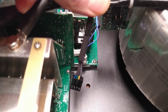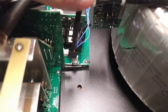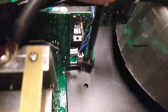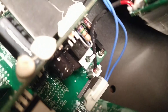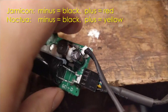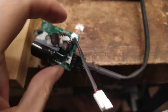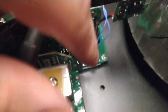I removed the bracket from the Yamicon fan that was installed from stock by Victron and connected the bracket to the Noctua fan. You can see it's a bit more slim and the screws on the other side do not fit — you could use longer screws, but this is solid enough so there's no need. If you connect your Noctua fan directly to the board, on the right there is black, on the left there is red, and on the board there's even a small plus marking for the fan. That is how you connect it on the little board, and then this goes in here.